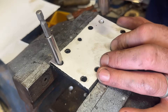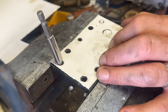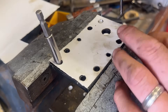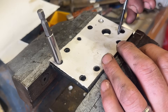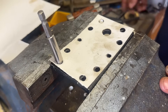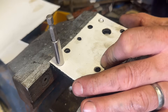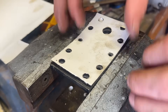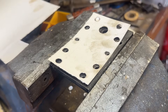The eagle eye might notice the steam needs to get in — that's where the steam pipe comes through the front of the cylinder. The old gasket was probably cut to clear that opening, which I will do again. If I don't do that and a bit of steam gets behind here, it could end up rusting the cover — water could get trapped behind there and rust the cylinder cover, which shouldn't be a problem because it's a nice thick cover, but it's not ideal.